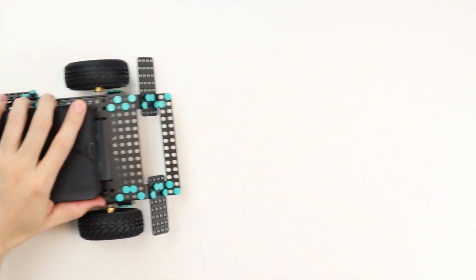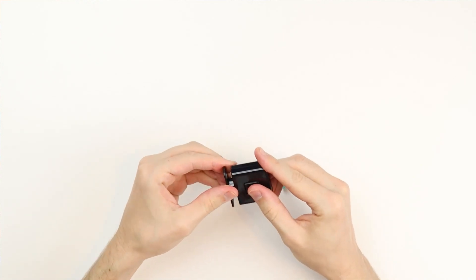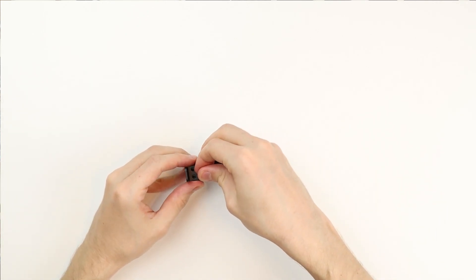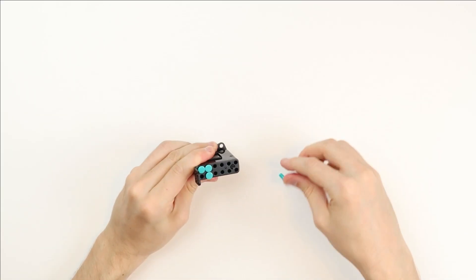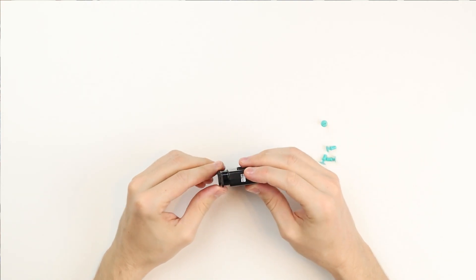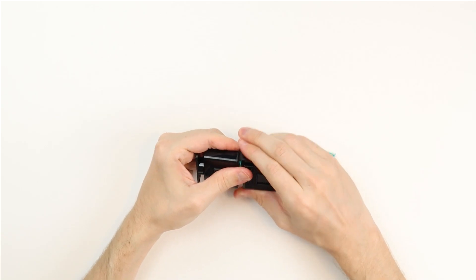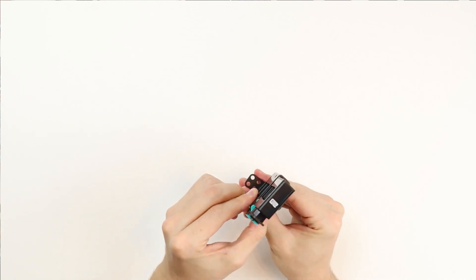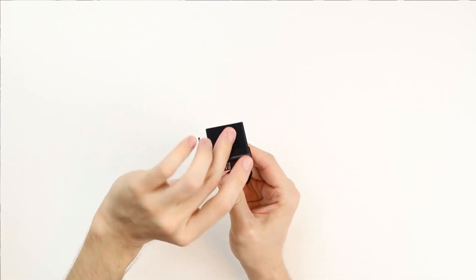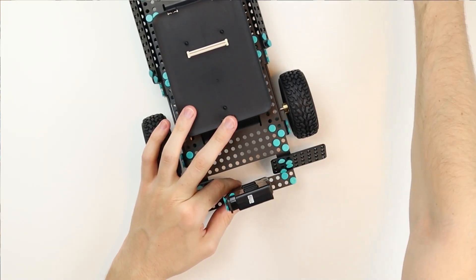We're really starting to get something that looks like a robot. Next up, we're going to be building the pan-tilt servo mechanism. Take one 2x2 90-degree bracket, one servo motor, and four short rivets. Place the 90-degree plate onto the base of the servo motor — make sure the bracket is attached to the bottom of the motor and not the top. Next, take the other servo motor and place the top of the motor so that the port is facing upwards onto the 90-degree plate. Use four rivets to secure the servo motor in place. By connecting the servo motors like this, we're able to look up and down, left and right — Alex is going to be able to look in all directions as it travels around. Now take the pan-tilt servo mechanism and attach it to the front bumper on the robot chassis using four short rivets.